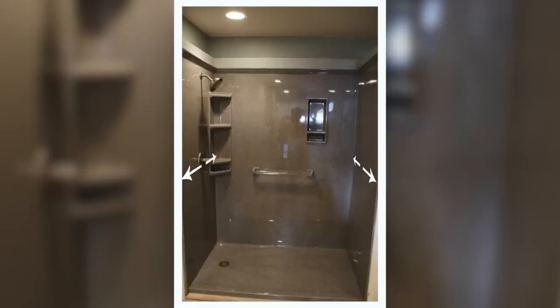Now let's move on to the wall panels. We're going to assume that each wall will be equal depth and height. Take your tape measure and place the end right up against the far corner sheetrock of your shower space. You want a measurement that will give depth to your shower, yet not so deep that there's too much room on either side. There's no right or wrong dimension for this measurement.